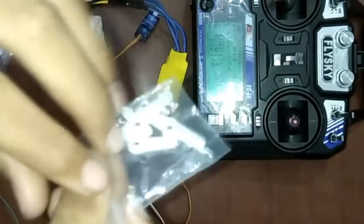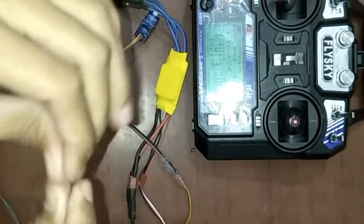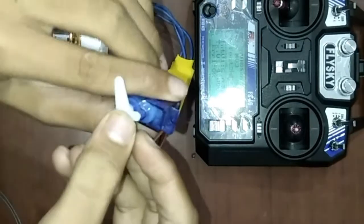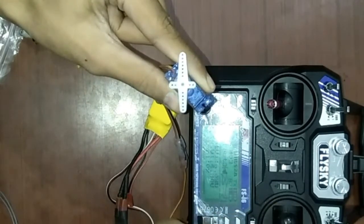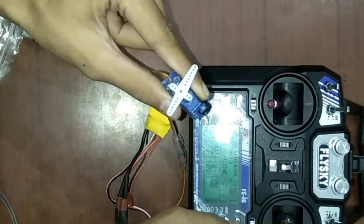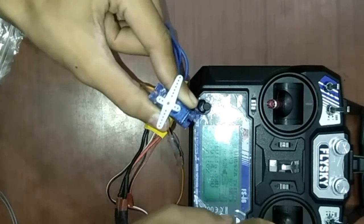You will get 3 types of linkage. Place the servo linkage on your servo and press it in. Now you will see: in the proportion which I move the stick, in that same proportion the servo moves up and down. When I move the stick horizontally it works because I connected the servo to the 1st channel, so it will not respond to the 2nd channel.